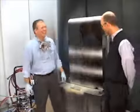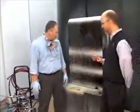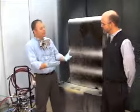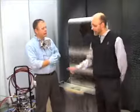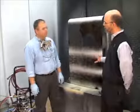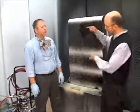Okay, so Mike, let's just talk about what you did here. The first thing I did was set 20 psi for atomizing. That's right, 20 psi, then you sprayed it to see what shape you had, and you adjusted it until you got about the pattern I wanted.